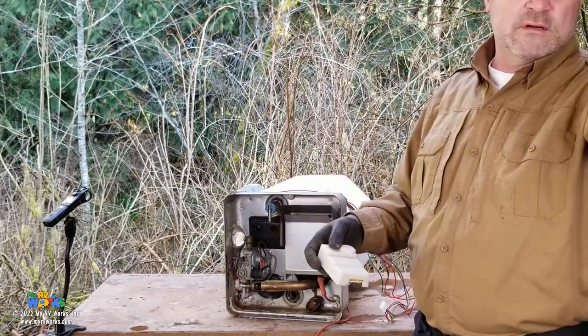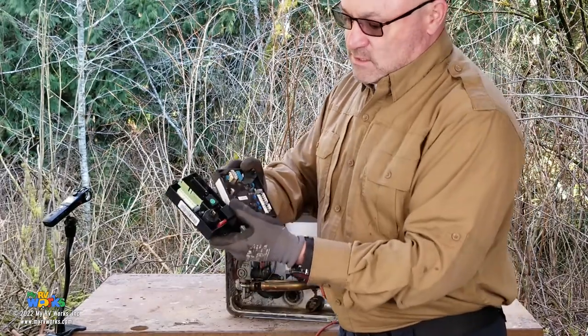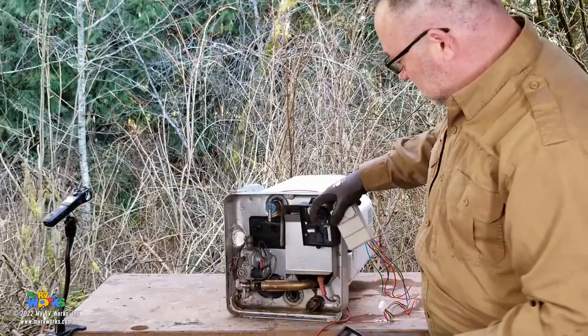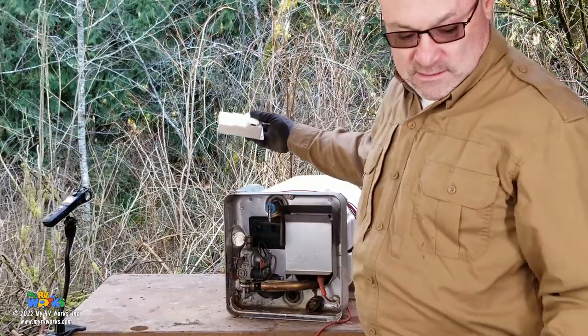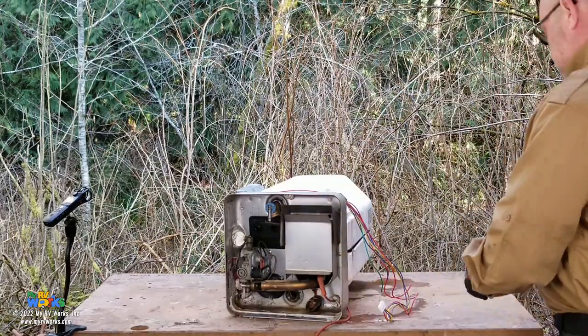Let me go grab a DSI board, an Atwood. Just one. Eeny, meeny, miny, moe. There we go. So these would be your Atwood Dometic DSI boards. These would be mounted on the front of the water heater on the outside, okay? The Suburbans are mounted inside your RV space, okay? We're going to come back to that in a minute.